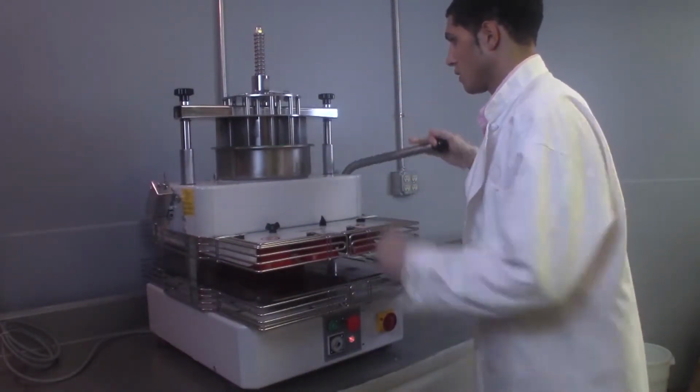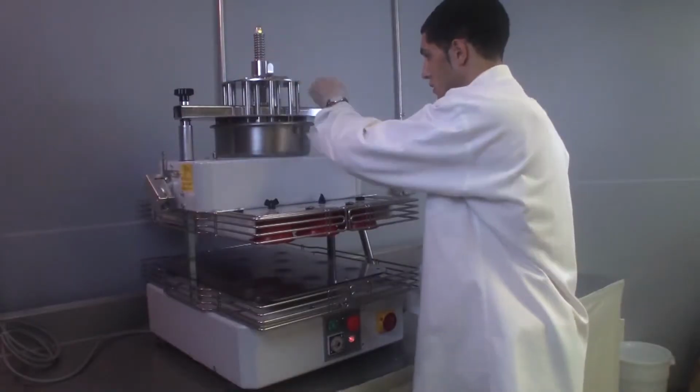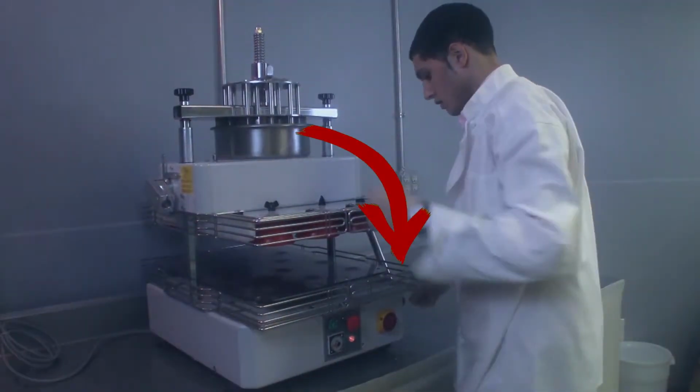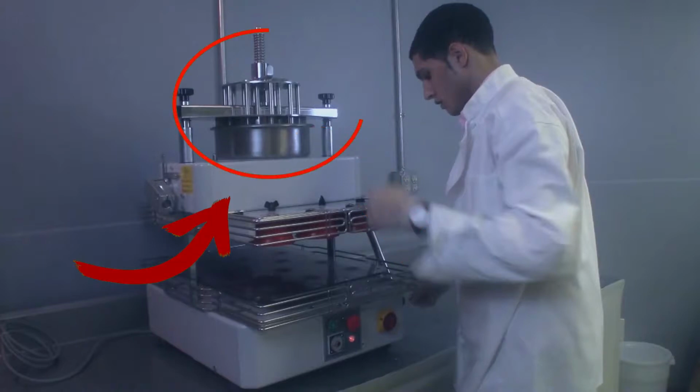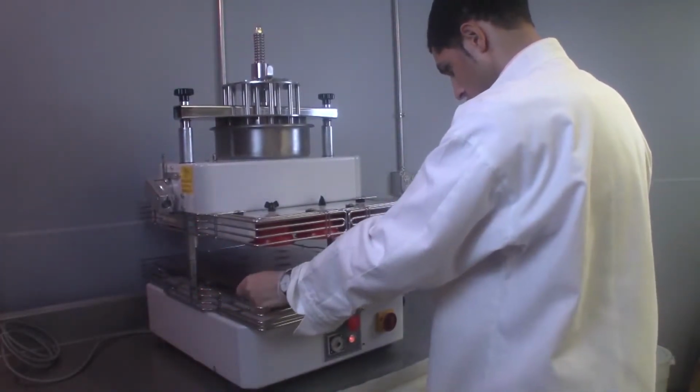With your right hand, pull down on the lifting lever and disengage the divider release lever with your left hand. Then pull the lifting lever all the way down. This will fully raise the pan and release the knives. Once cutting is complete, the handle lock will engage to hold the upper rounding plate in the raised position. Remove the dough tray.